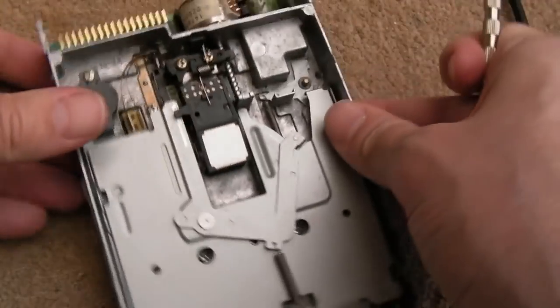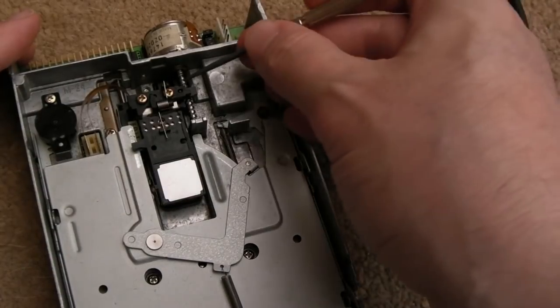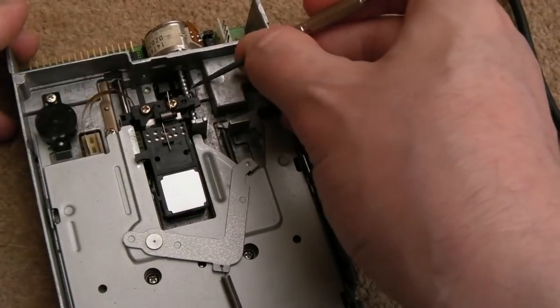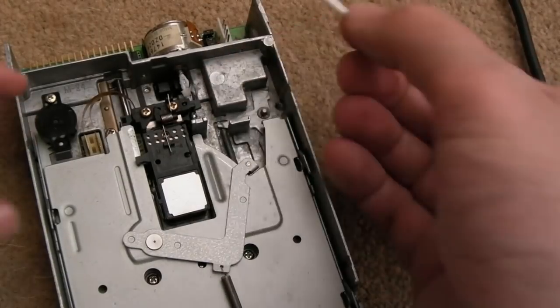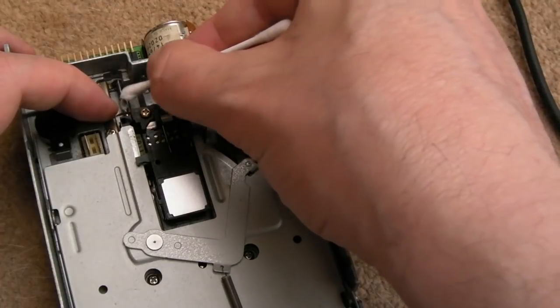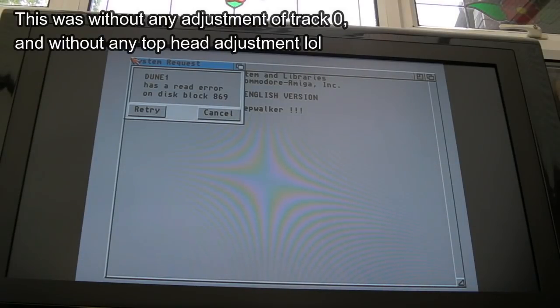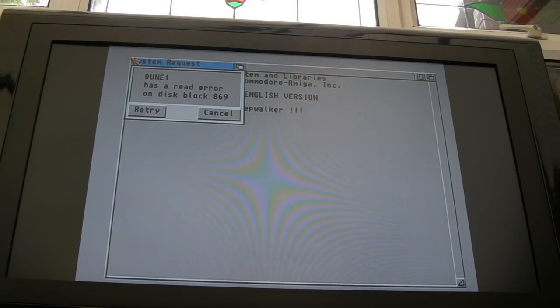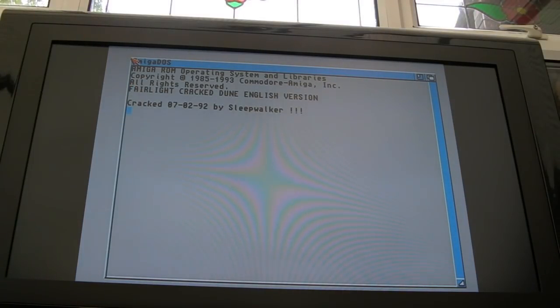I had a quick look down there - the heads are almost aligned, so it's approximately right. The reason I knew there was an issue with that ball bearing was that when I moved it now, you can move it. Couldn't move it before - it was impossible. So now that's sorted, let's get a little bit of fresh grease on. I've got no doubt I'm going to get exactly the same error as before - getting to a certain point on the disc and then getting a bad sector error. And the amazing thing is, after putting it back together with no further alignment adjustment, I'm getting exactly the same error - which is actually a good sign. If you've taken one of these drives to pieces and messed with the heads, 99 times out of 100 it won't even read a disc after reassembly.